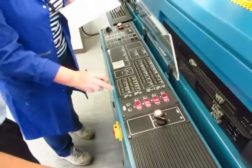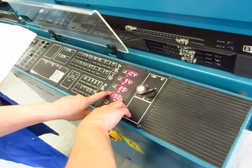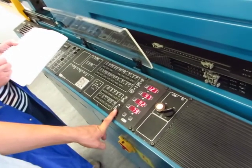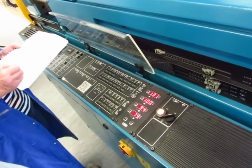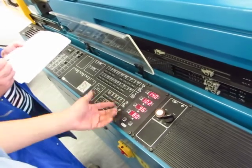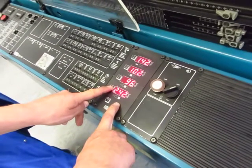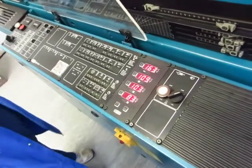And you've set those — press that. What you have to do is, for the zone that you want, press and hold the thermometer symbol, which brings up the set point. So we've got four zones — one, two, three, four. So it's whichever zone. Press the left hand side button. And then you set it up and down with the arrows. Or if you press and hold it, they go up quicker. And the higher it goes, the faster it. So that's sorted temperature outside.